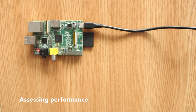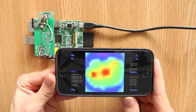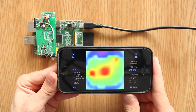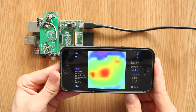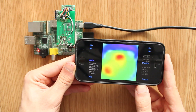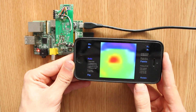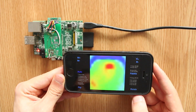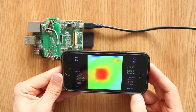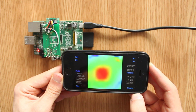For a quick assessment of performance, let's take a look at the Raspberry Pi board. We can immediately spot three areas that show elevated temperatures. One of them seems to be coming from the linear regulator that's powering the board. The other one seems to be coming from the SOC, where we have a maximum temperature of around 51 degrees Celsius.